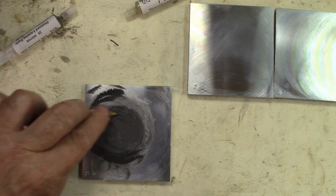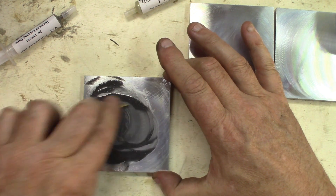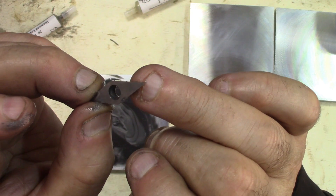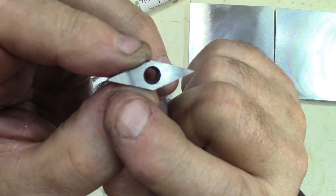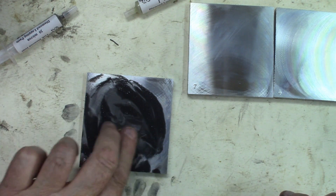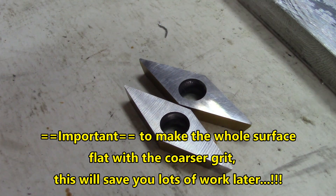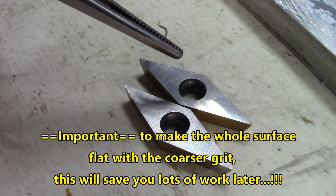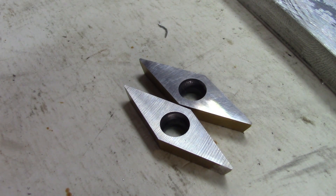Keep it wet. What the plan is with the rougher grit is to get rid of all the major lines. We're still having some lines in there, but quickly coming into a smoother surface. Slowly getting there — you can see the demarcation line there. I've been at it for about five, six minutes, but this is a very important step in the process. This is the original insert with all the streaks. Now the 20-grit is done and it's done evenly — the whole surface is very even and starting to show a little bit of shine. We're going to go from the 20-micron grit to the 7-micron grit.